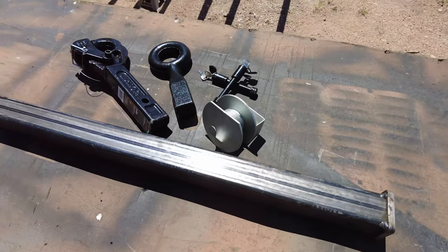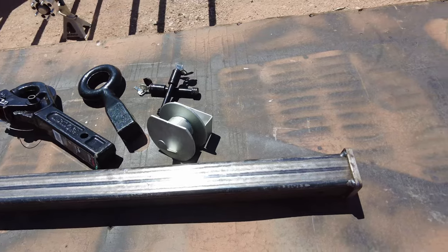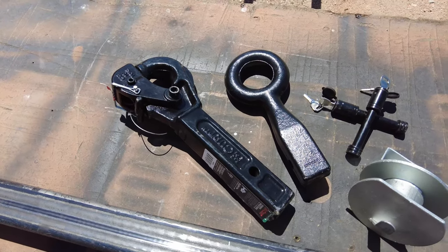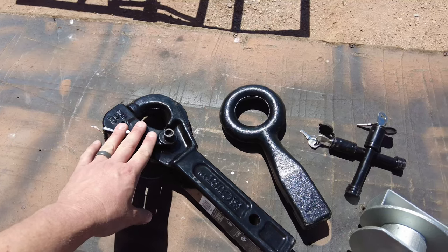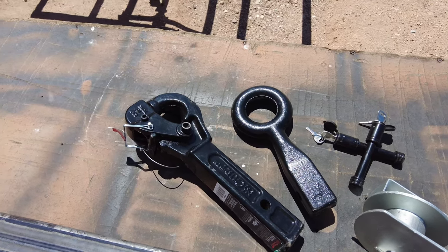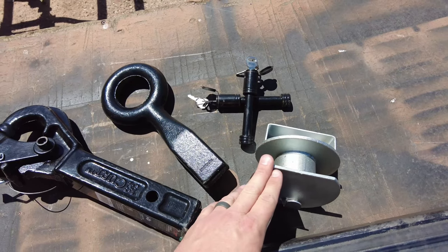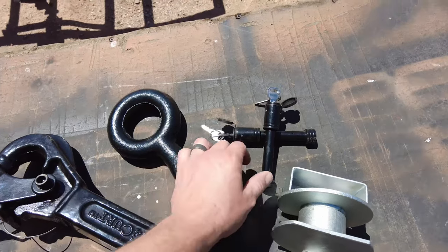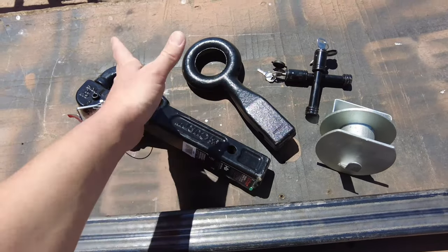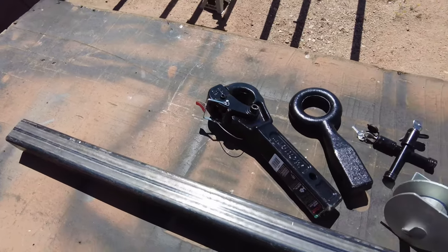On the trailer, I went with a 48 inch receiver tube so I can easily jackknife the trailer and the Jeep on a trail to either turn around or at our campsite. I went with the pintle setup because of how strong it is, and I do like that there is only a certain amount of articulation between the ring and the hitch, so your trailer wouldn't roll on the trail if you got something really off-camber. I have the lock for the lunette ring so no one could steal it, and I have locks to secure the lunette ring to the receiver tube and the mount to the vehicle. I got everything off Amazon, so I'll leave links in the description below if you choose this setup.